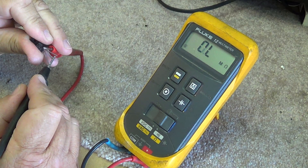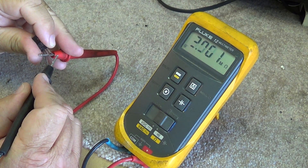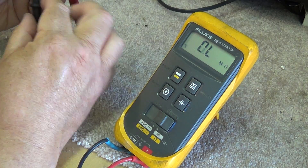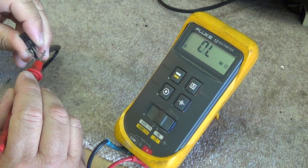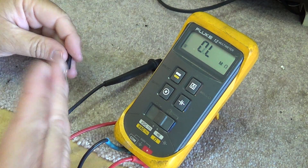In the reverse direction it's open, and it's open there as well. If I put my negative on the base — this being an NPN transistor — it again measures open. So you can measure it with an ohm meter, or more preferably the diode test function, because then you're actually testing the voltage drop across the junction.